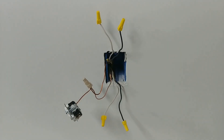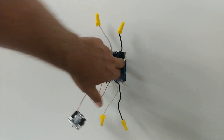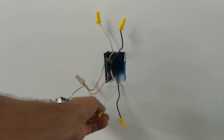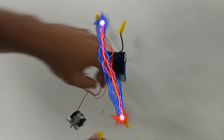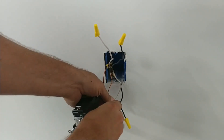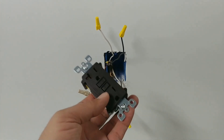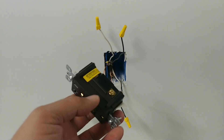Here's the most important part of the video. Once you get your outlet out, you'll have at least two Romex cables inside. Separate the hots and the neutrals and put a wire nut on each one so there's no fear of getting poked. A lot of people make a very common mistake when hooking up a GFCI outlet, and that's why I wanted to make this video.